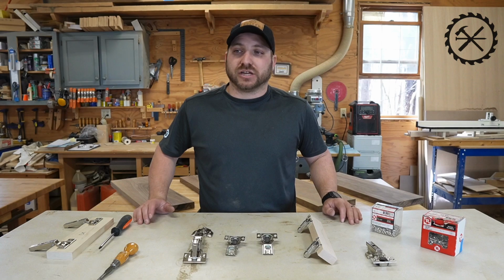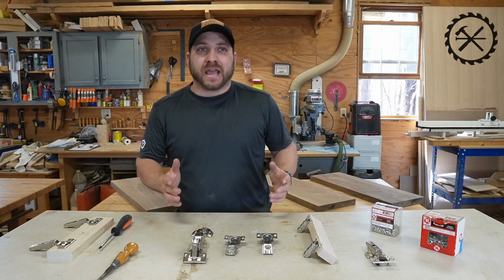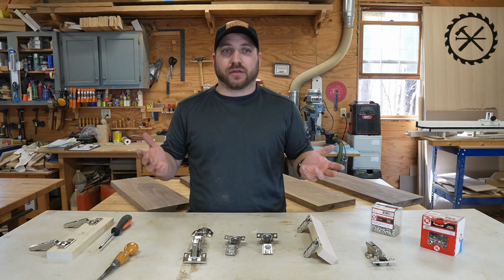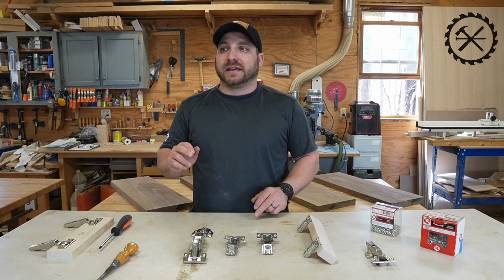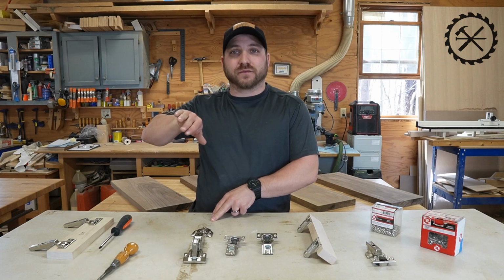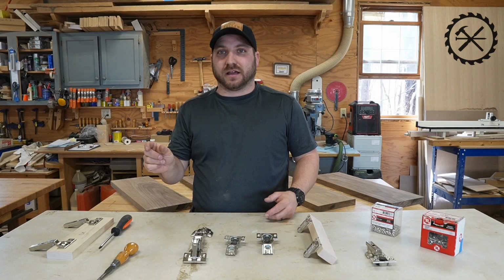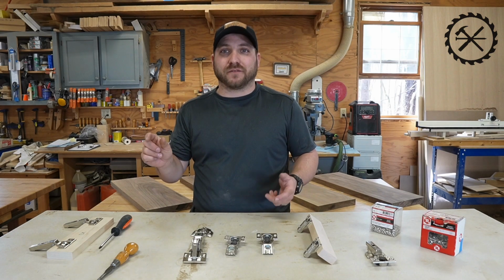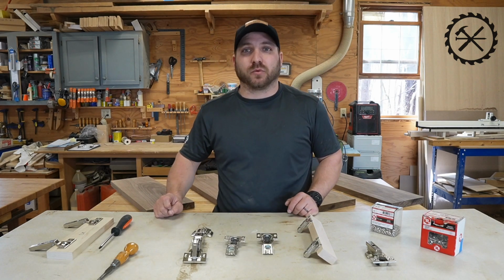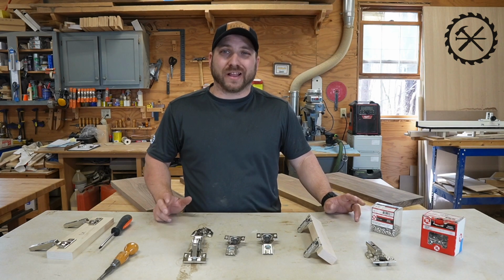I just did a job the other day where we did a hamper unit. It was a giant unit, and I did 1/2 inch overlay because we were up against the wall. But I'm glad I did, because another thing I hadn't thought of is they had, I want to say, 8 inch baseboard. So it actually came up and butted into the face frame of my cabinet. I'm really glad I did 1/2 inch overlay, because after 1/2 inch, you now have 1.25 inch of your face frame that's seen. And that was 3/4 inch baseboard that was butting in. So I was saved by that, but I would use that up against the wall anyways.